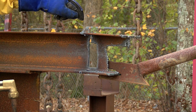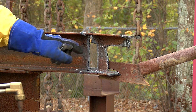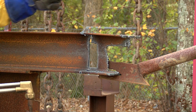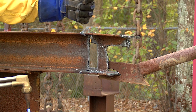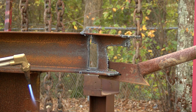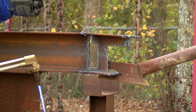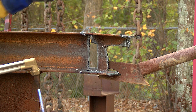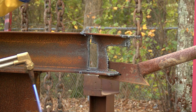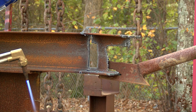Once we've worked through that four-step process — the top flange, the web, cutting out our window if needed, and then working on the bottom flange — at some point we're going to start to see the movement we've been looking for in the controlled lower. At this point we'll come off the cut lever and just apply heat to what's left of the metal still connected, to let the cantilevered beam lower onto cribbing, rigging, or down onto the ground at the rate we want.